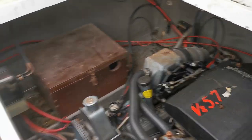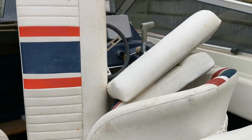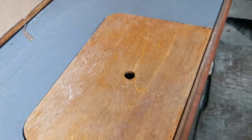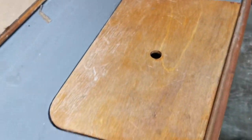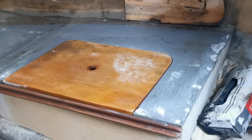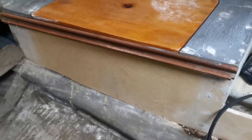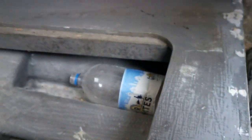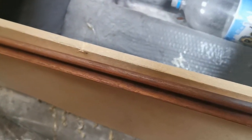First of all I think we'll clear the crap out of the boat and see what we've got and what we haven't got, then we'll come back and have another go at this engine. So this is what I found - there's a little table, it looks good, little cubby holes. Nice glasswork - the glasswork on these old Sunseekers is absolutely beautiful. Nice teak-faced ply on this side. Obviously that's leaked into it and they've rebuilt this, unfortunately using MDF which really isn't ideal. But it's not a horrendous job - I think if I just flow coat over it, it'll probably be just fine.